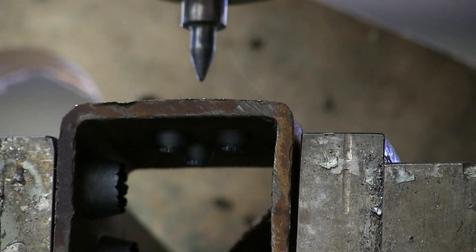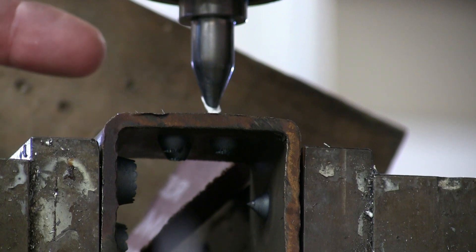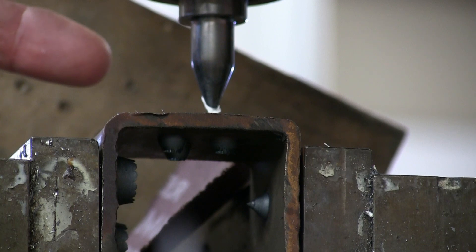The lubricant doesn't really seem to do too much on the small quarter-inch hole, but we're going to move up to the half-inch hole. Another question: why am I peck drilling with the larger size, allowing it to cool off? I had thought this was painfully obvious, but Dunning-Kruger and so forth — I will show you why I'm peck drilling.